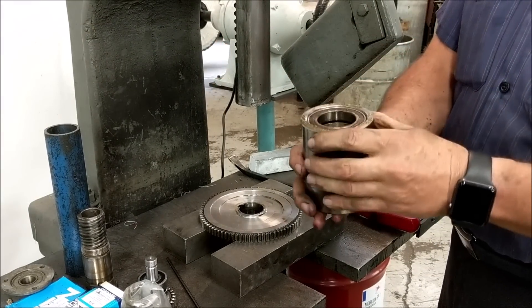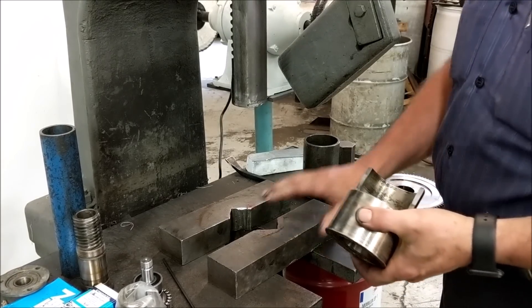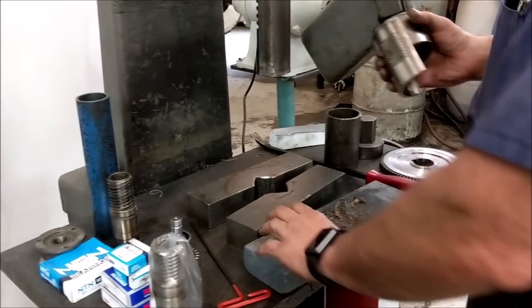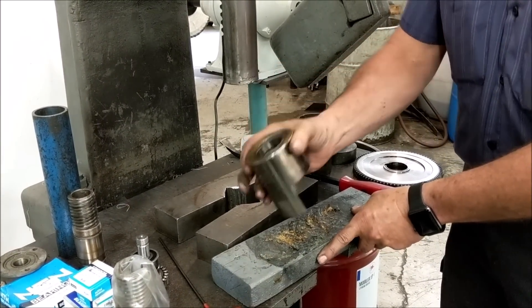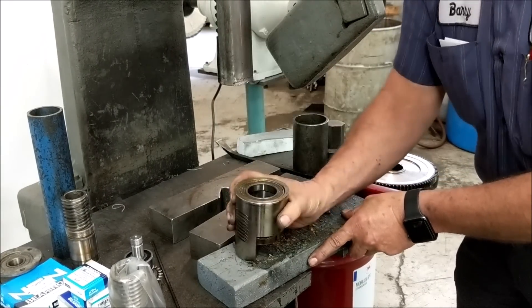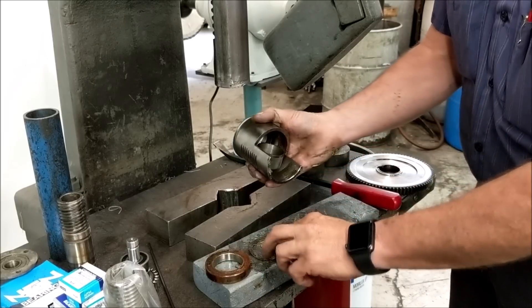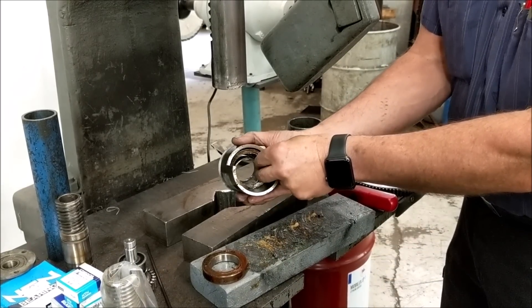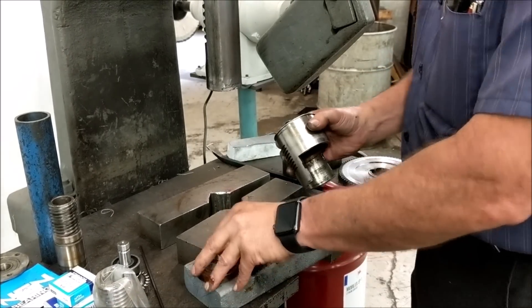At this point on your large bull gear there is your bearing housing and then there is your bull gear side. I use a two-by-four — this isn't necessary — and you just work it apart. There's your bearing. The wavy washer goes underneath on the bottom bearing. There's your spacer.